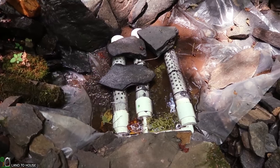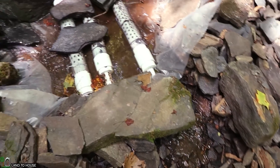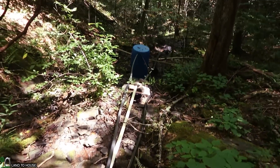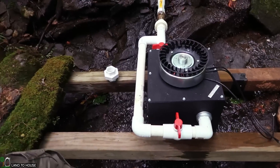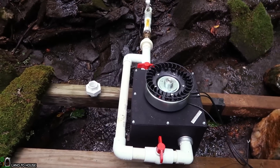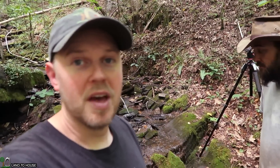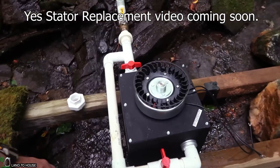After two weeks, this is what the intake of the system looks like. We hiked up here just to see if we were still having any overflow — there's just a little tiny leak right here but most of the water is going where we want it. We've got basically full flow of the creek coming down our intake to our barrel. With the quarter inch nozzle open, it's still pulling more water than we have available. We're guessing somewhere around five to six gallons a minute, and this quarter inch jet needs at least 12 to flow full. So we don't have enough water to run this thing as much as we need to, but we do know it will run at about 30 to 35 volts. We may also have to send the stator back to Spencer Langston and have him rewire if it's not going to have high enough voltage.